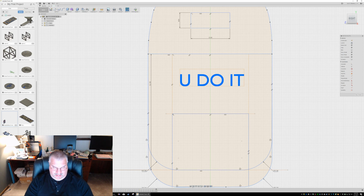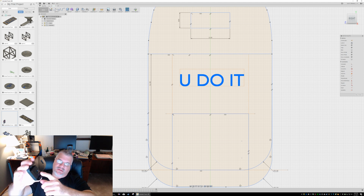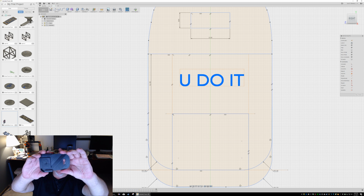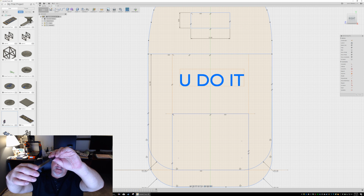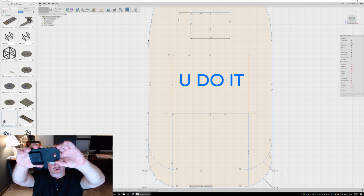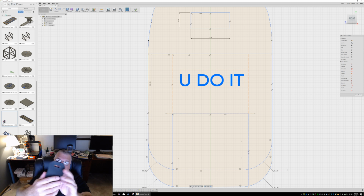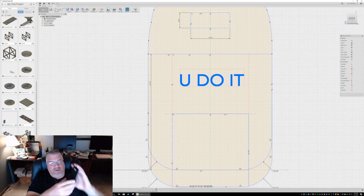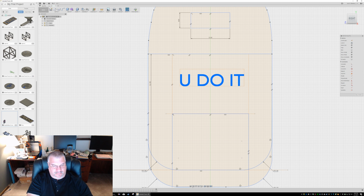So now the thing with this is by embossing the logo in there, you'll see the logo embossed right in here just a little bit. I'll bring it down like a half a millimeter. Shouldn't really do a half. Since it's 0.2 millimeters, I'll do maybe 0.4 millimeters down. And you'll see it on this part. So if you screw it, because I have this indentation here for a screw hole, if you screw it onto a wall, you'll see the logo.